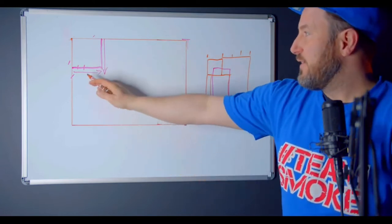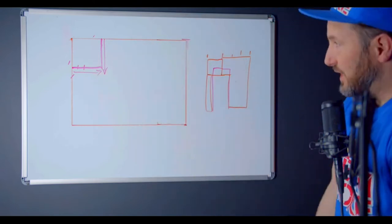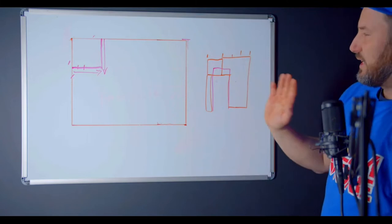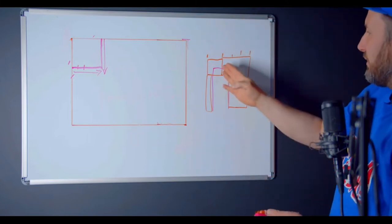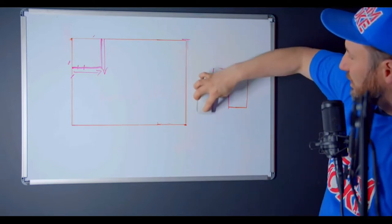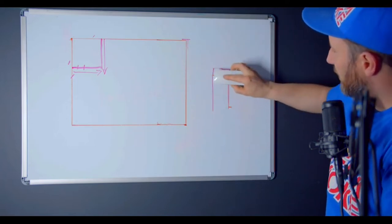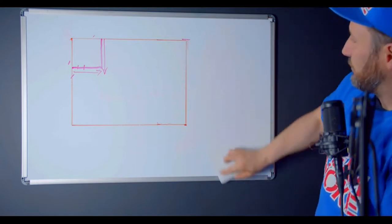If you don't like the configuration, make adjustments to your 16s — it's simple. If it doesn't work this way, try the other way, if it makes more practical sense. Just always check for that; keep checking for your doors and make sure drywall works. That's how we want to drywall doors: with a butt joint, a full piece, and a leg.